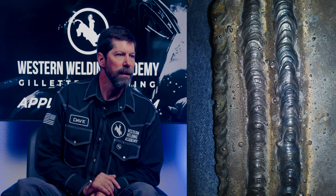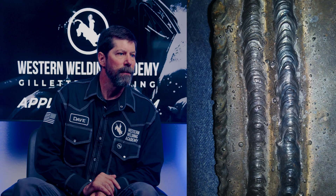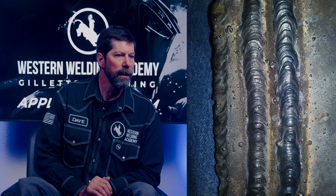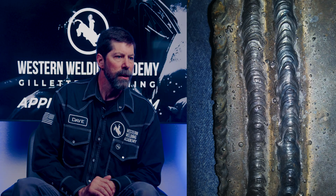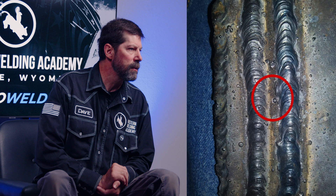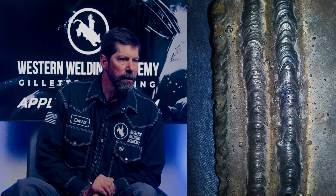We're looking at Hayden. He is 15 and he's stick welding. He writes us: I'm 15 years old, I'm from Michigan, I have never welded a day in my life before. I was running a 6013 eighth-inch rod on quarter-inch steel plate on flat. I'm a big fan of you guys, keep up the good work, I love the content. Thanks, Hayden — great to hear that you like what we're putting out there. Now, as I'm looking at your weld here, I'm seeing a lot of changes in your speed — places where your bead is a bit thinner and then a bit fatter where it is starting to stack up. Try to clean up your beads after you weld on them. I can see where it has been scored on the side, so I can tell that you haven't taken a wire wheel to it.